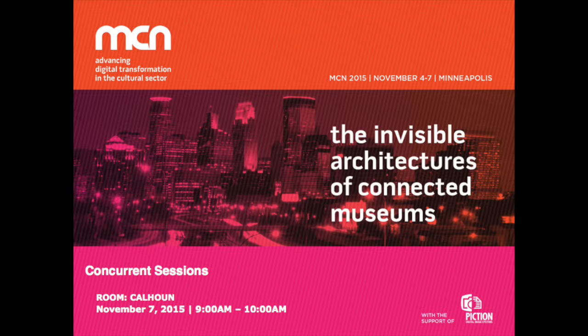We got the frames back from Micah, and Kurt put a first coat of Kilz on to seal them up. I got a raw frame that was just basswood, very rough, and had to make it look finished. I covered it with a coating of white shellac, a couple of coats to flatten everything out. Then I used gold paint — there's a red undercoating and then the gold paint. It was a really good gold paint, but it is not gold leaf by any means. It's just a big faking job.